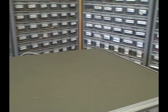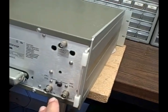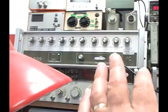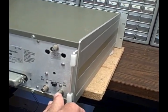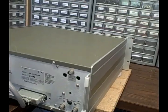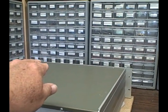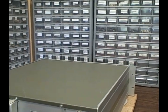There is an input on the back for an external standard and a switch to go from internal to external. So if you want to put an external reference like a rubidium in, you can. Or if you choose, you can use the 10 MHz from the internal crystal oscillator. As long as you buffer it properly through a distribution amp, this oscillator can become your bench standard for all equipment that runs off 10 MHz. The main output is on the back; there is a front output connector but it's not connected — you can move the output to the front by disconnecting from the rear.